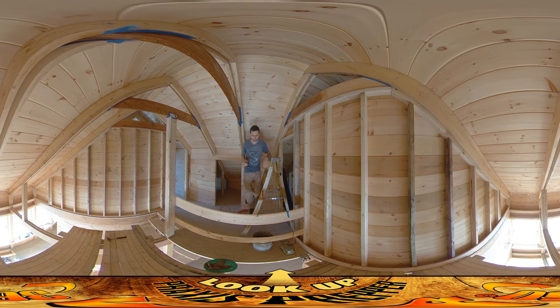The last step I want to show you that I'm doing on these is, before they completely dry, I'm taking a rag. I would normally wait until I did the entire thing, but just for demonstration purposes, I'm taking the rag and brushing it across the surface, and that brings out a lot of this natural beauty in the grain right there, because I'm taking the excess off of what it easily wipes off of, and you see this natural grain pattern so much better.